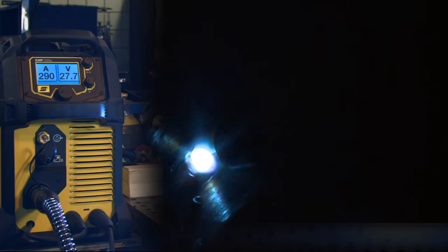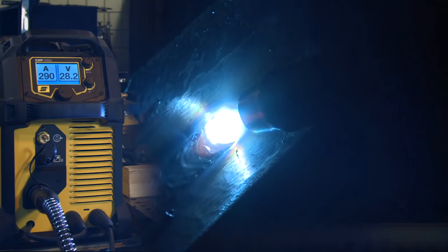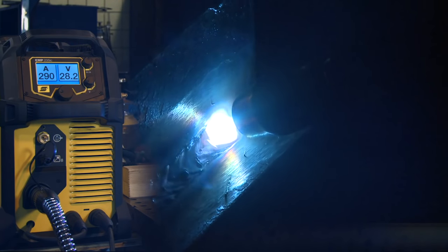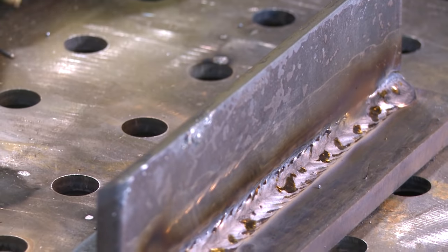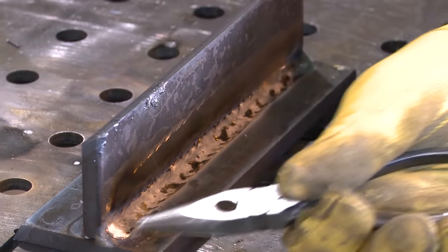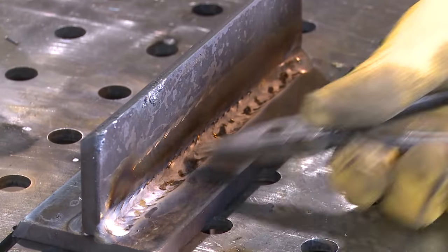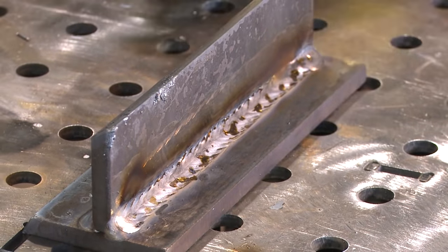One thing to note when I'm on spray — I do have quite a bit longer stick out, about 5/8 to 3/4 inch. It's got a little glass showing. I want to cool this off — just dip it in the tank and take all the latent heat out of it. I want to do a 3-pass weld. I'll lay one on bottom and one on top but I won't finish them all — I'll leave them staggered so we can see all three passes.